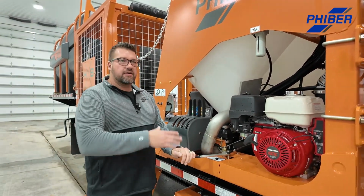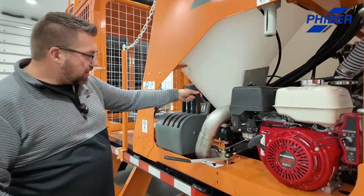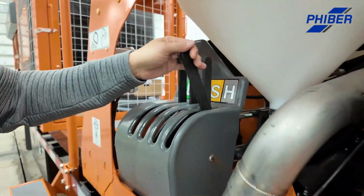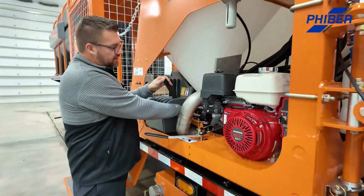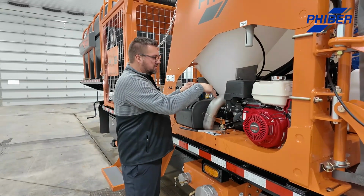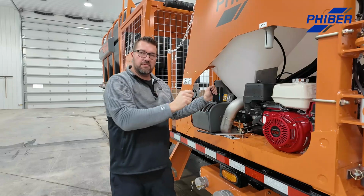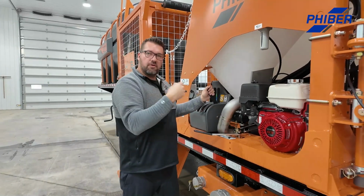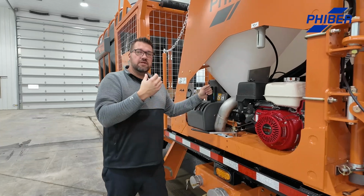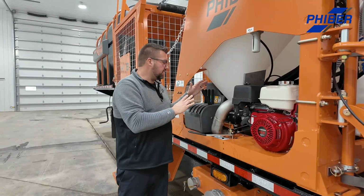Now you're pumping water to your sprayer. So 3-inch valve, open all the way. Now, what I can also do is there are always corresponding handles to different inductors. As I pull this handle, it does 2 things. One is it opens a chemical valve, letting this inductor drain into the water as it's coming. No venturis, and anti-vortex plates in the bottom of every inductor, so there's no toilet bowl effect happening and sucking air. Most of our customers don't even use defoamer anymore because it flows so simply that way.